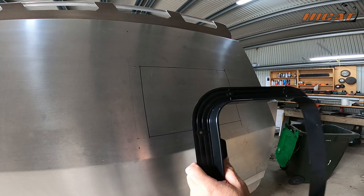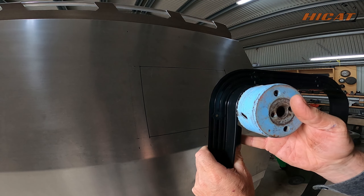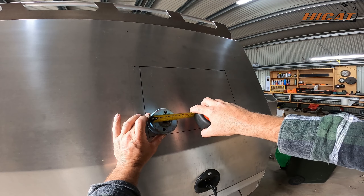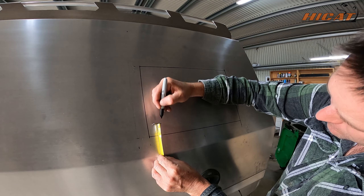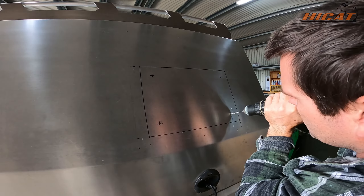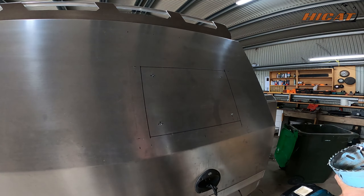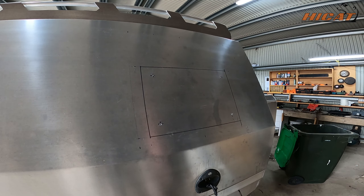To get these rounded edges we're just going to use a hole saw. A 75 is pretty close — it's going to come up okay. To mark your holes for your hole saw, get your radius — here that's going to be 37, close enough. We'll come up 37 and in 37 on each corner. I've marked the corners; now just go to the small drill bit — there's a locator. Because it's such a big hole saw I'm going to use a little bit of cutting fluid, just to make sure the saw stays in good nick and the metal doesn't heat up too much.